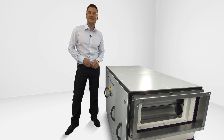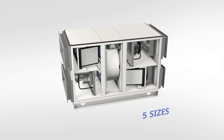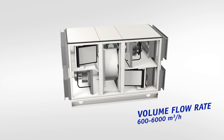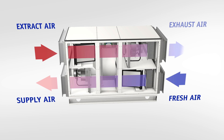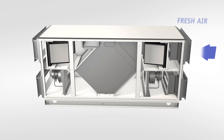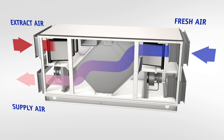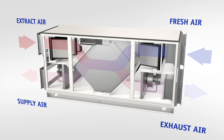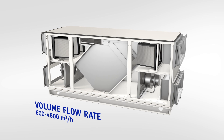The X-Cube Compact comes in a choice of two systems for heat recovery. The X-Cube Compact with heat wheel is of minimum length, yet ideal for maximum heat recovery and humidity transfer. It is suitable for volume flows of 600 to 6000 cubic meters per hour. Here you can see how the counter-current flow principle works: fresh air is supplied from one side while room air is extracted from the other, with the air flows moving in parallel. With the counter-flow plate heat exchanger, they cross each other. The X-Cube Compact with plate heat exchanger is slightly larger and ensures completely separate supply air and extract air flows. It is suitable for contaminated or polluted air and ideal for volume flow rates of 600 to 4800 cubic meters per hour.